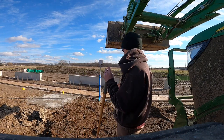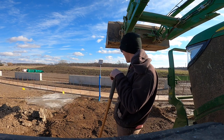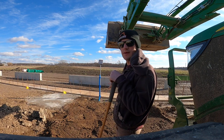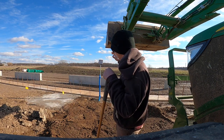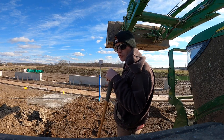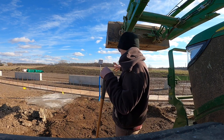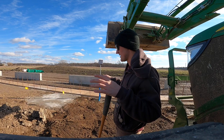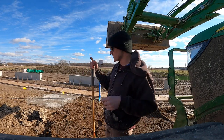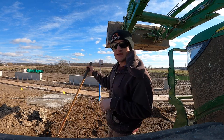So I'm hoping, well, I'm not hoping, Justin is hoping. He has said that we'll get that 3/4 stone in under that hydrant, because what happens is when you shut that hydrant off, yes, the water drops down and drains out that connection. So this way, when we shut it off, that 3/4 stone will take that little bit of water that'll come down the pipe and it'll go somewhere. And then the nice thing is it's not going to freeze up if the barn gets down below zero.